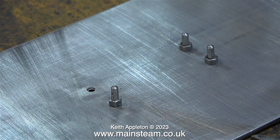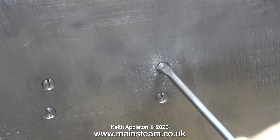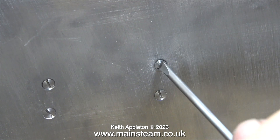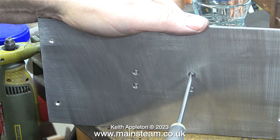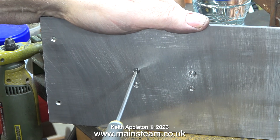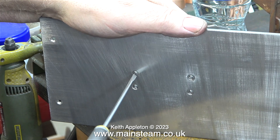Originally, by the way, I threaded the pieces of brass angle — I thought I'd mention that for any viewers who haven't seen the previous episode. These are five BA machine screws with countersink heads. Here I'm checking the tightness of the bolts, because I don't want them to be tight — if they're tight I can't screw them into the brass angle. Once I was happy that the steel nuts fitted to these machine screws on the other side were not tight, I screwed them into the brass angle from underneath as shown here.